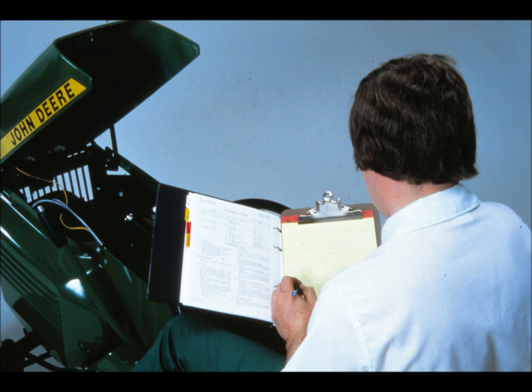Think about the symptoms and draw up a list of possible causes — that's step five. A discharged battery is an obvious possible cause. The problem could also be the starter motor or the starter motor drive, or there might be a problem in the wiring. The engine might even be seized, but that will be quite evident because you won't be able to turn it over by hand.